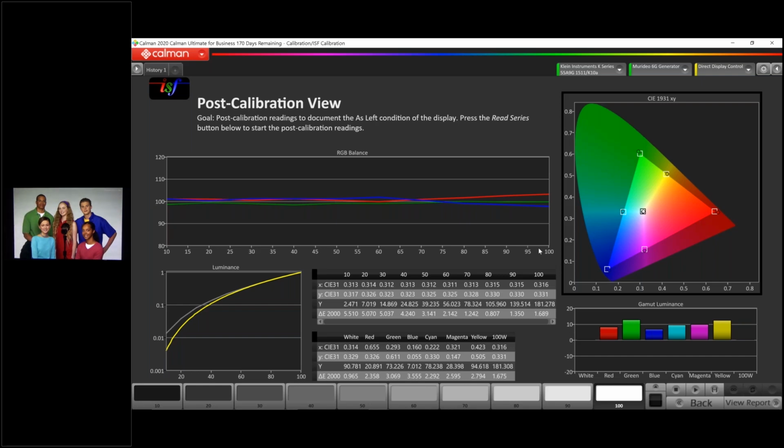The sharpness is correct because remember when we were looking at the sharpness before and it was making all those halos and ringing artifacts around the lines? On this test pattern, if the sharpness is too high, these people have these lines around them and they look like cardboard cutouts, and it's really, really strange. But they have nice, smooth, soft edges. That all looks good. The grayscale background looks neutral gray. That looks really nice.